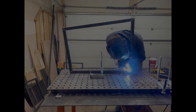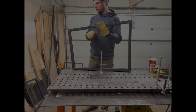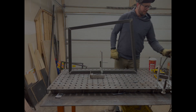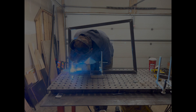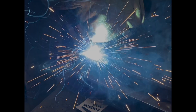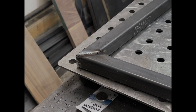Now that the two sides of the chair are tacked, I come back and weld the inside corners of each side. I find that doing this and then flipping them face down and welding reduces the amount of warping. I'm not a welder by trade — I'm actually an elementary teacher — but once the inside corners are welded, I lay it flat and complete the rest of the welds. Once the welding is done, off camera I took both chair sides and the seat and back outside and ground down all of the welds nice and smooth.